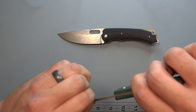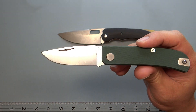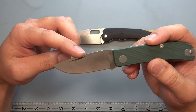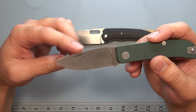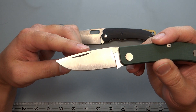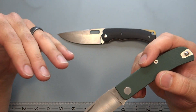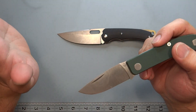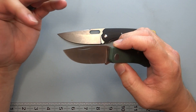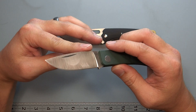So that's going to be this knife here. I looked at this one to see what the primary percent is. The Manly is going to be 6.76 degrees, which is about a 12% grade. And then looking at a standard kitchen knife — a very cheap one I had on hand — that one is about 2 degrees, which is like a 3.4% grade.